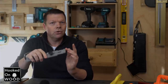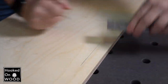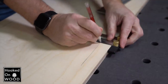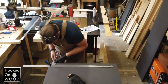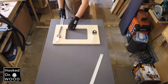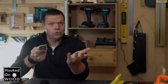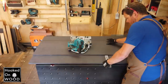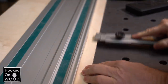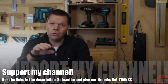This ruler turns out to be very nice to use. I like that it is so wide, so if you have to mark a point you can keep the ruler still and draw a long enough line. Its size and weight make it slide easier alongside the edge of a piece of wood to draw a line. What I really like to do with this ruler is align pieces - I used it a lot when building my workbench. Its weight and size are beneficial for aligning things. It is easier to slide a piece of wood to the right spot, and because of the big front it has the body to do so. With the big knob you can tighten it very quickly and strongly, so even a heavy piece of wood will not change your settings. And because of the more oversized front, it will not slide under a piece that you want to align. So what I thought would be its weakness turned out to be its strength, and I really started to love it. It has become a tool that earned a permanent place in my workshop.